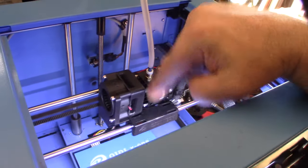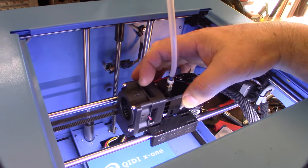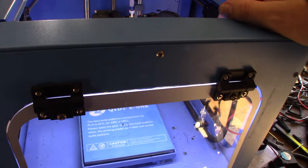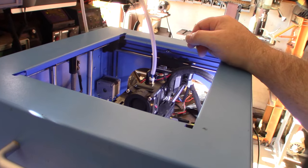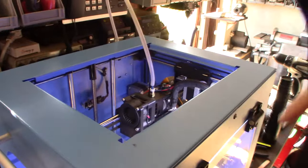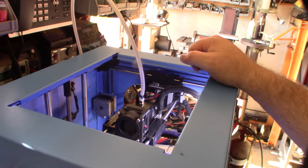I've got good airflow coming through here — the 35mm fan is inside the ducting and I'm getting air on three sides. I'll heat it up to 260–290 degrees and do an ABS test cube. What I'm testing is a calibration cube in ABS, but because the part is so small, the layer doesn't have time to cool down — that's where the layer cooling fan comes in. For a really big part, there's enough time between runs, but for a small part you need a layer cooling fan.